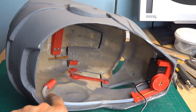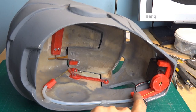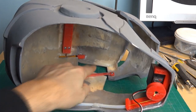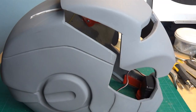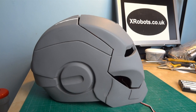So I've now got hold of my tube, which is a PTFE tube - otherwise known as Teflon - which has a 6mm outer diameter and a 4mm inside diameter. That's attached between basically the pulley assembly and the block, and this yellow string runs all the way - that's actually shark fishing line which is 65 pounds of force it can hold. It's doubled up, so the loop is round the hole in the lever and the other end is tied off on the pulley. As you'd expect, as the pulley turns, it winches open the faceplate. I've also installed a small spring which is a soft stop at the top, and it also stops the faceplate overbalancing too far and getting stuck. So all that brings this back is gravity as the winch unwinds. I've just wired that into a servo controller linked to my laptop. Next time I'll be covering how to actually fit electronics and program the servo, so look out for part two!